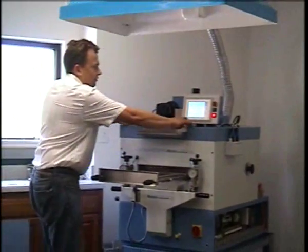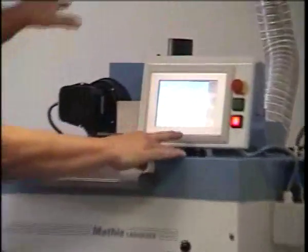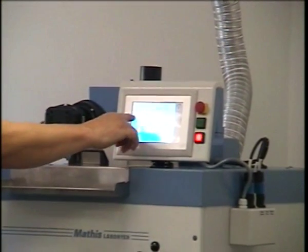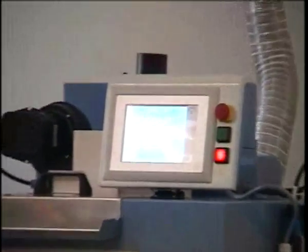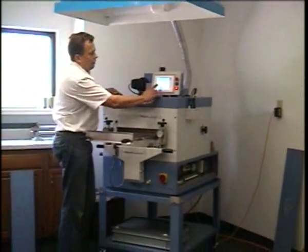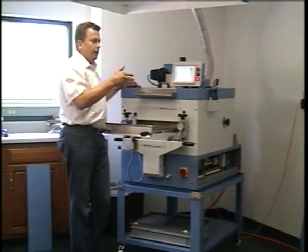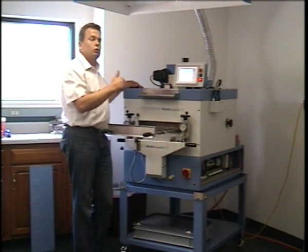At the bottom you have controls for surface temperature. That is the infrared parameter here. You have 3 modes. Normal mode, mode 1, means the operation is only monitoring the surface temperature of an area right here. Mode A allows you to enter a trigger temperature, which should always be about 5 degrees Celsius, 10 degrees Fahrenheit, lower than the circulating air temperature of your dryer.